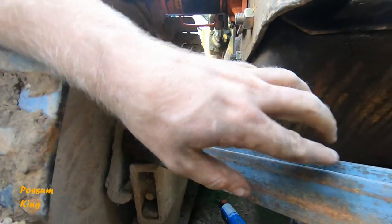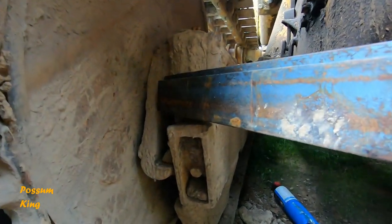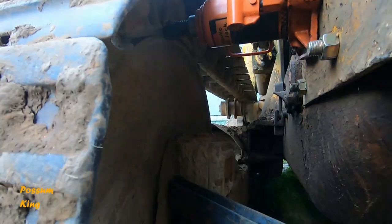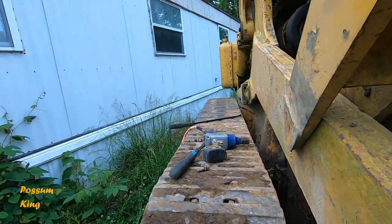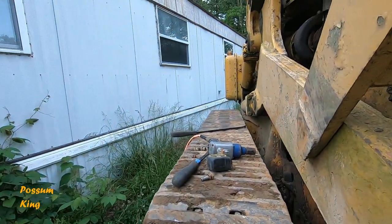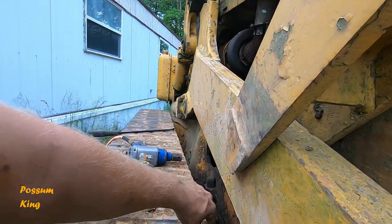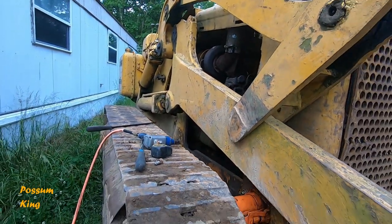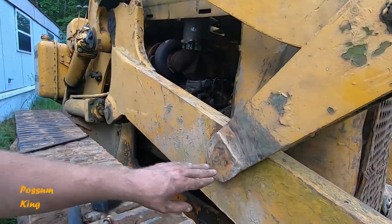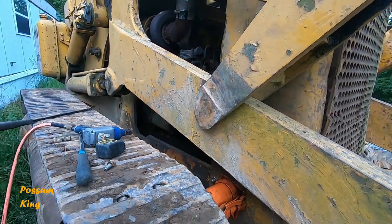I had two pieces of angle iron of each quarter inch. So I add them together, makes half an inch. And I shoved it in there, I took the pressure off the jack, and certainly things moved back this way a little bit, but I have about half inch clearance using the tape measure between this point and this point. Before it was zero, because I mean it was riding on there and then it slipped right on there. I mean there's a lot of pressure.